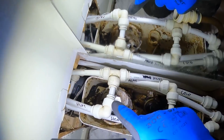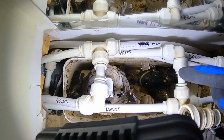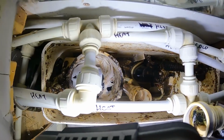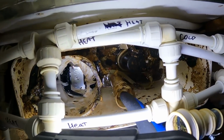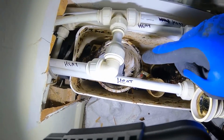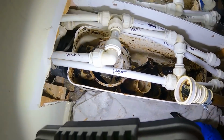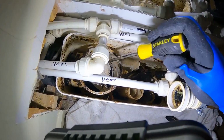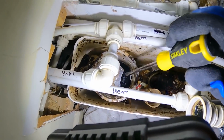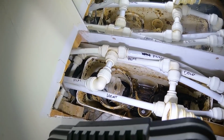And so obviously that's your macerator, that's your outlet, so it gets chopped up in there, pumped into here, and then a flow switch inside lifts, tells the pump to work, and it pumps everything out of there into this pipe and out. Now, I've literally just got the lid off, looking in, it looks to me like there's some rope or something. The power's off to it, so we're all right, but I think this is what's getting into the blades, spinning, chopping and vibrating and making it do what it's doing.